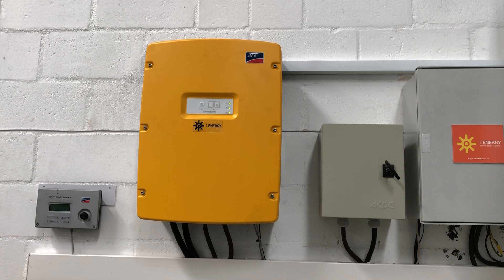Green indicates any state of charge above 50%. Orange indicates any state of charge between 20% and 50%. And red indicates any state of charge below 20%. Green is preferred to be displayed at all times. Orange, if depending on your battery settings you have decided to discharge your batteries below 50%, is then acceptable. But red, meaning state of charge below 20%, is not advised.